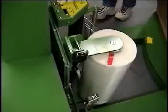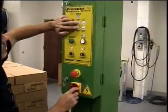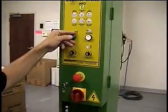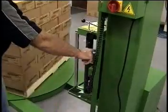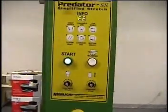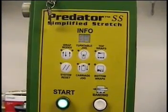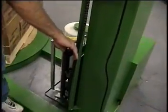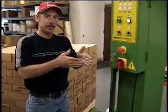Let's run into that test again. Simply turn off your machine, make sure your stop is out, put your fingers on both jog buttons, turn the power on, and hold it until you get EE. Now it's ready to run again — let's see if we fixed our photo eye problem. To do it quicker, you can trigger it yourself. Back down to the bottom. Turntable prox — we've got to find its home. We have E4 again, because when I stopped the carriage here, the photo eye never got a chance to change its state. That's what it's looking for: the light to be on and off once it gets above and then come back down. It needs to change state.